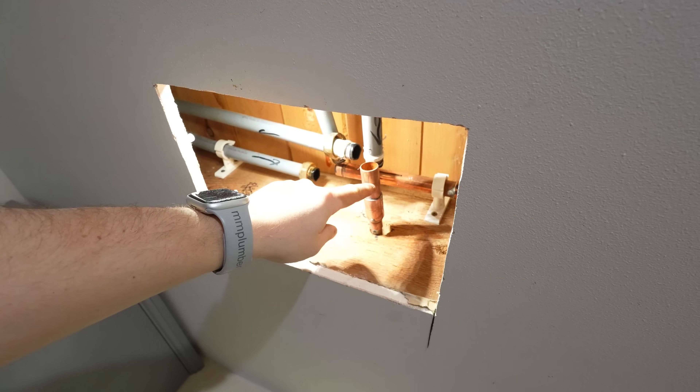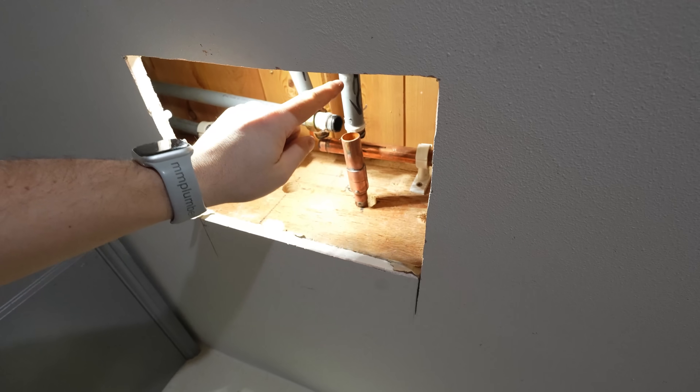With that socket soldered, my thought pattern was to make the pipe longer so I can actually press it, as we've got constant water in it. If I go to try and solder some tees up in place, especially that one, it's probably not going to work - it's going to be really hard to get this water out. So what I'm thinking of doing now is getting a press fitting onto here, cutting these plastic pipes back, fitting some push fit connectors on - which is the right sort of connection instead of going into compression - and then just coupling it all up. That should be good.